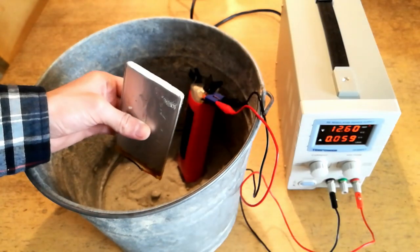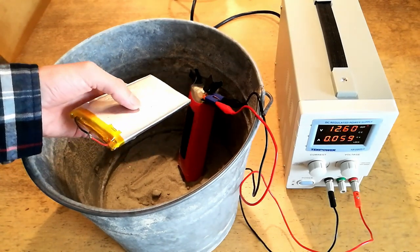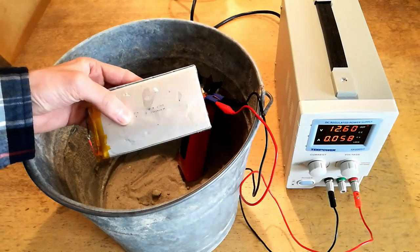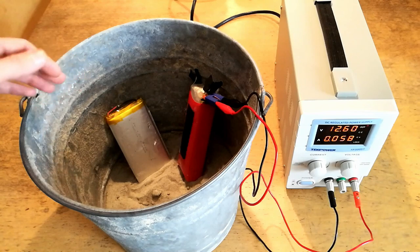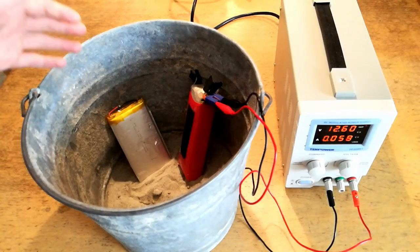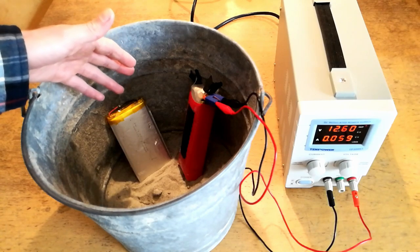The reason for this is that the organic electrolyte and the plastic polymer material within these batteries is extremely flammable. If the batteries are crushed or damaged in the disposal process — whether it be in a garbage truck, a trash compactor, or the landfill itself — then an electrical spark within can ignite those flammable materials. This is why it's so important to make sure there's no stored electrical energy in the battery.